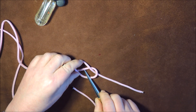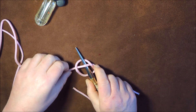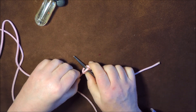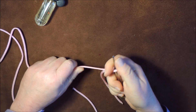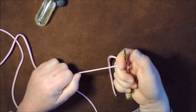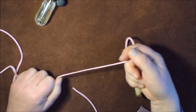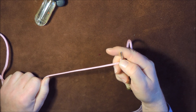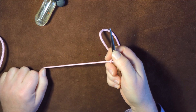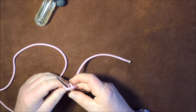Then what you do is get your marlin spike, pass it in underneath that loop in the middle, and then pull on both sides evenly. That locks it into place and you have something to grab hold of and pull really hard — it won't come undone. So if you've got a length of line and you want to get some extra purchase on it, just use your marlin spike hitch to pull it up and it will take a lot of strain.